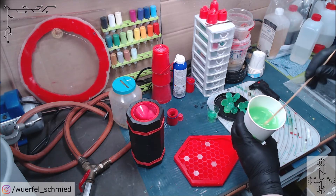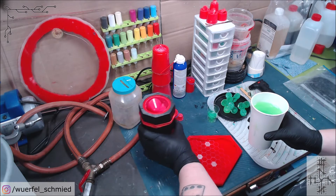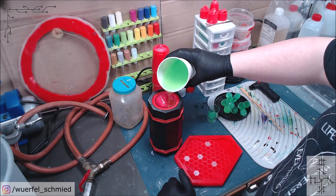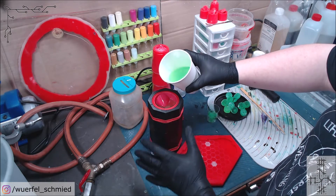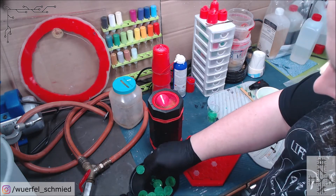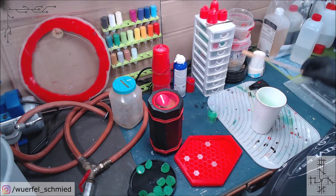I'm not sure if the camera will catch the silver swirls that you see here. I hope this will be transparent enough at the end. I start by filling the big mold — nothing too fancy here, just let it flow in. Because this will go into the pressure pot, I don't worry too much about small bubbles. I fill it up to nearly the top, and then I start adding some of these bits here. These will not have the exact same color but they are close, and I really like to see these at the end — the reason we put them in is to recycle them.